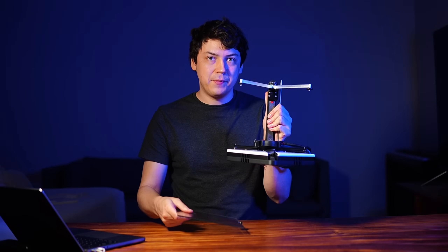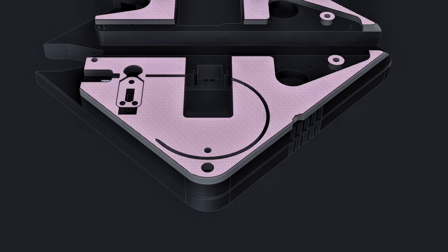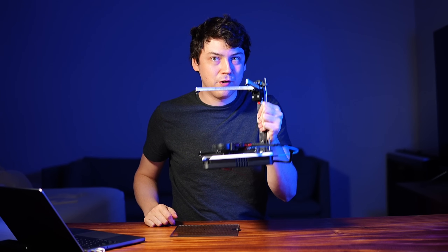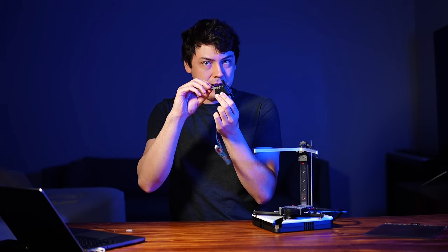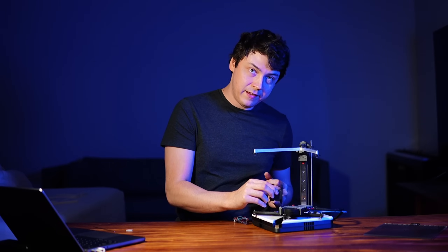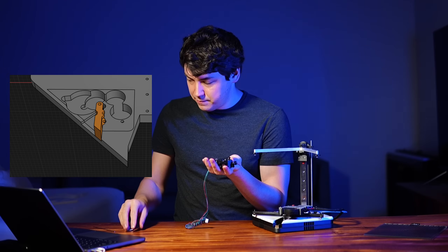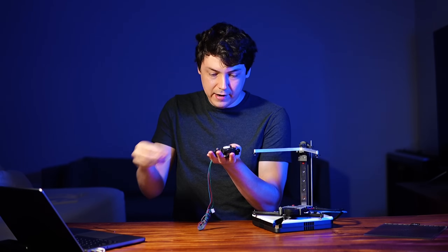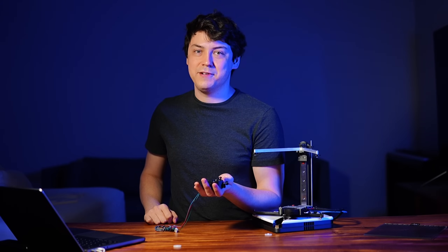As for the left top plate, I had mentioned I wanted to move the extruder off of the Z axis and into the main body, thinking of some of the last remaining space inside of it. In a portable printer you want to see all the space being used efficiently. First, I walked down the wrong path by trying to copy the Hummingbird extruder design into the unibody. However, the Hummingbird is too tall, so I tried to split it in two and fold it over. But to get power transmission to the drive gears, I had to add two gears and shafts — this was getting stupid.